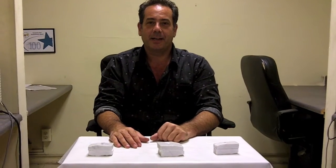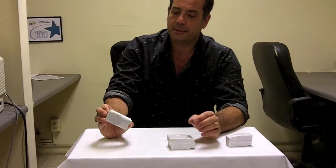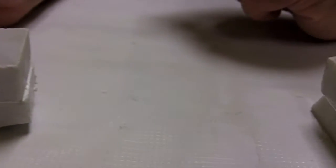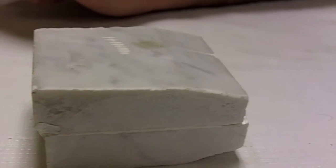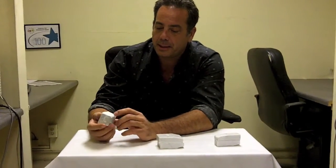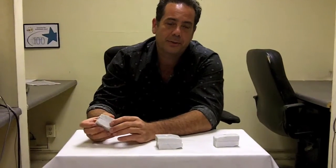Hey, it's Daniel with Bonanza again. It's been more than 24 hours and we've let our samples of solid clear glue dry. The manufacturer's instructions suggest curing takes place within half an hour, but in our case it took more like 12 hours — maybe because we didn't add as much hardener as most people do. The faster the curing time, the lower the integrity of the bond.